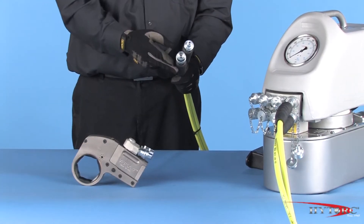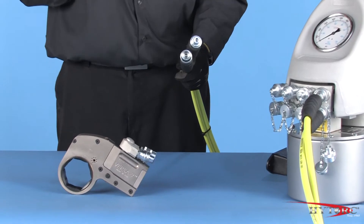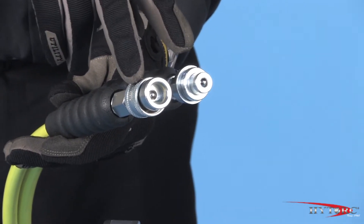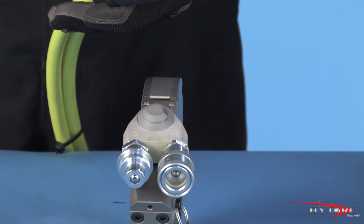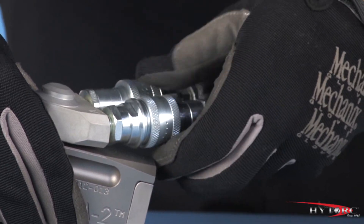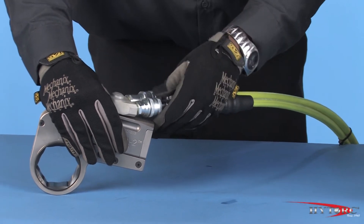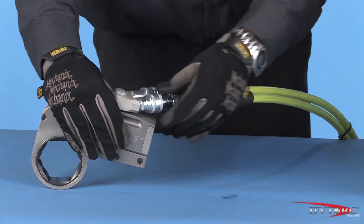The Versa is powered by hydraulic oil from a pressure-regulated system connected by a special set of high-test hoses. Note that both the male and female unions feature a small, spring-loaded check ball which must be fully seated for the oil to pass. Ensure that the hydraulic hoses are firmly screwed to the tool's hose connectors using only finger-tight force. Even the slightest loosening of the threaded connector will shut off the flow of oil, preventing a high-pressure leak that could otherwise be dangerous to the operator.